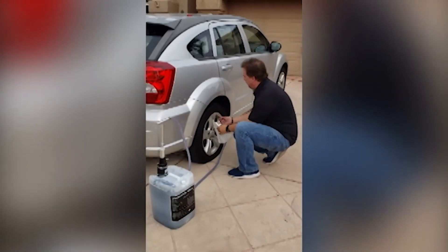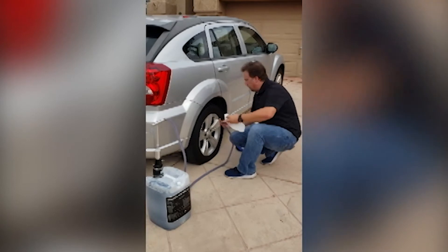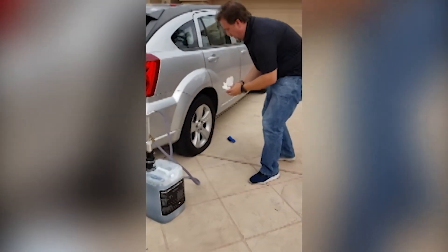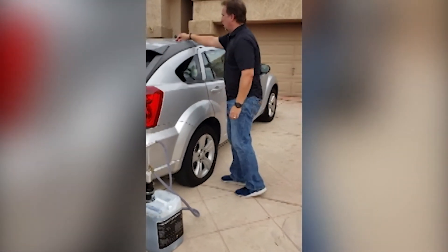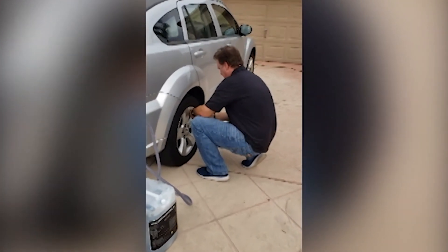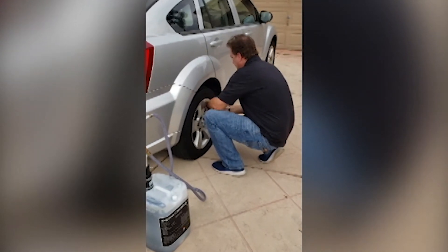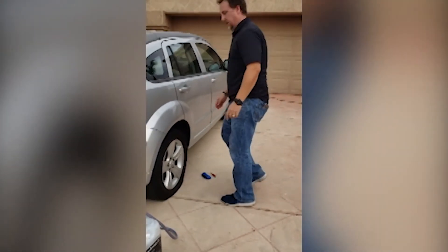Make sure you've got your paper towel, then take the pump off the stem. Be very careful that there's no product left on it. A little product may come out of the stem, but as you can see, you just use a paper towel to clean up — very simple and straightforward. Now we're going to put that core back in, make sure it's good and solid, then turn the compressor on.